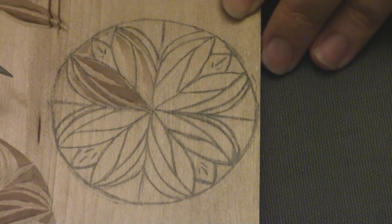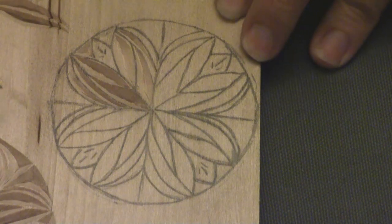Since the chips are so close together, a stacking approach is appropriate. Stacking is a method that minimizes the chance of removing wood not intended to be removed. Specifically, you don't want to bring all of your chips down to the same point when several chips come together. If you do, you risk undercutting into adjacent chips, and as you move around the pattern, you can lift out wood that was meant to stay in place.